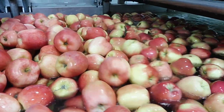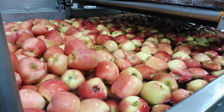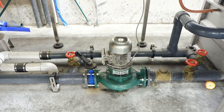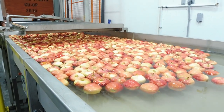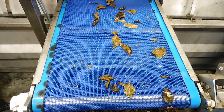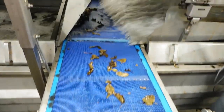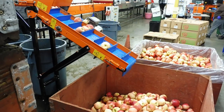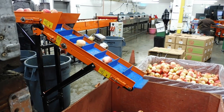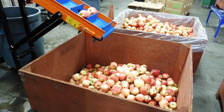The apples are starting to float as the bin is pressed down to the bottom of the tank, so they all float to the top. A water pump pumps water in, keeping it a couple of inches above the flume section, which creates a current. That current carries the apples down into a rubber disc bed where leaves are removed. We also have a cull belt where apples with blemishes or bruising are taken out — those go into making juice.